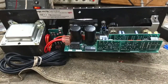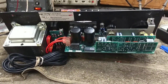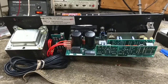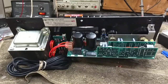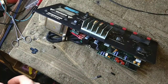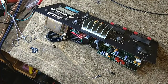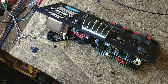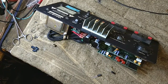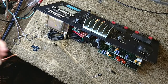I'm going to go ahead and pull the parts and install them, then install the amp module and test it to see if it oscillates. If it doesn't, awesome. If it does, we're back to the problem of the accelerometer being bad. Let's get cracking on that. I'll try to get some good shots so you can see replacing these things. They use these double-sided solder pads, which are kind of terrible. I don't much care for them, but they exist and I have to deal with it. It's best to use some solder wick here.